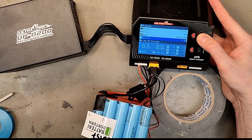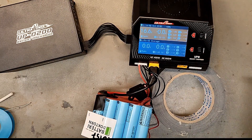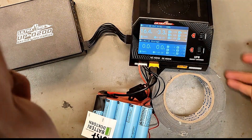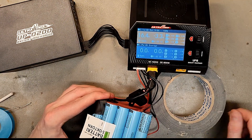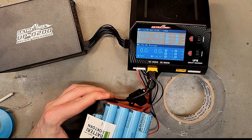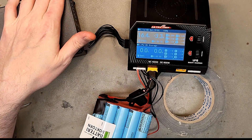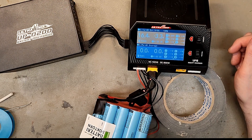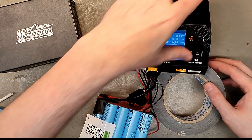Let's try 3.3 amps. It's another color on the display — it's hard to tell, but more of a reddish-orange color. It's counting the milliampere hours. What a nice charger — this one I'm going to keep. The fan is spinning here as well, of course. Does it say how many watts we're at? I guess you have to calculate, but it's around 50 watts. Really cool chargers.